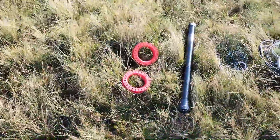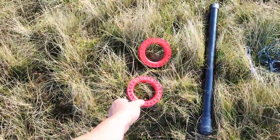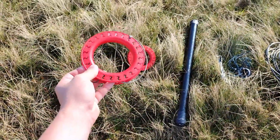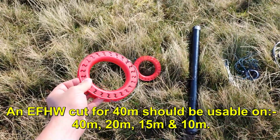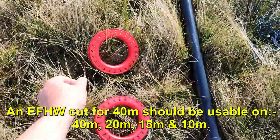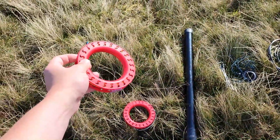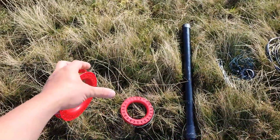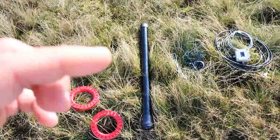Let's have a look at the equipment. The antenna itself - that one is an EFHW (end-fed half-wave) for 40 meters, also good on 20, and would probably also do 10 though I've not tried that. My second antenna wire is a half-wave for 60 meters. So I've got a choice of bands - I can either do 40 and 20, or I can do 60. Two options there.